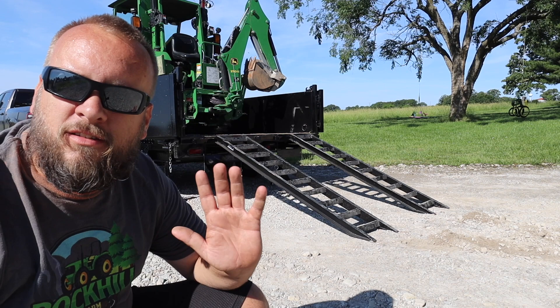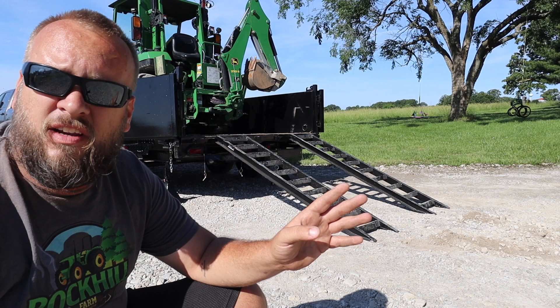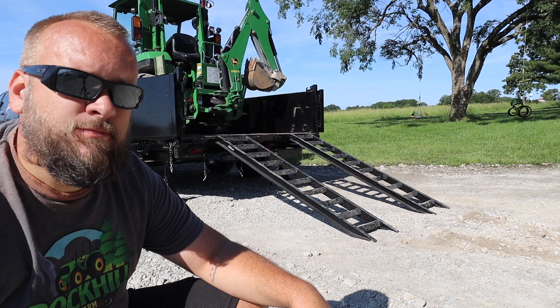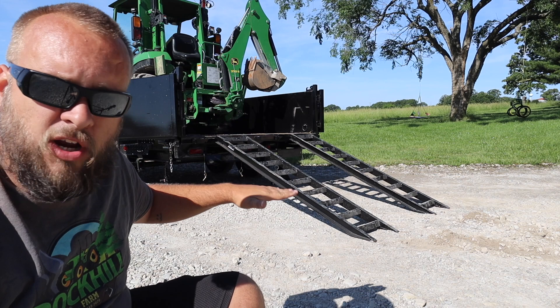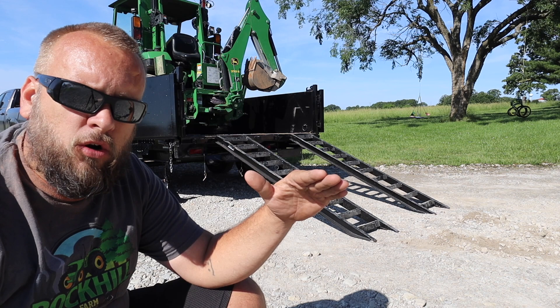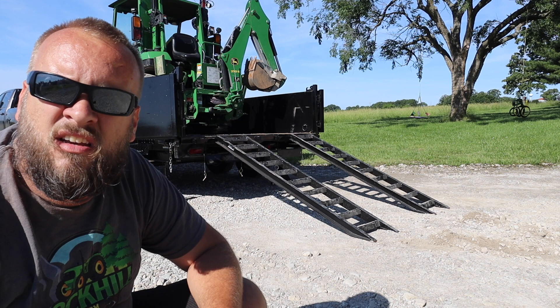Now we've got it loaded and the doors are going to close, so it fits. It did still scrape a little bit but not too bad — I'm going to say it's fine. I wouldn't want to do it on concrete, but in dirt or gravel this will work on my tractor. Having the dump bed at an angle is a suitable solution. Another solution would be having the trailer lower — like if you backed up to an incline, a little ditch, or a bank where the tractor is loading from a spot higher than where the trailer is sitting.